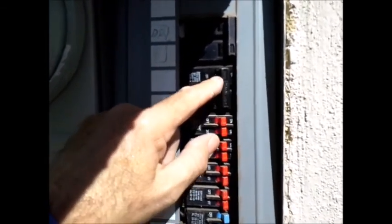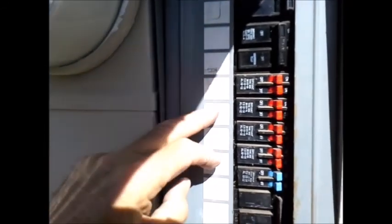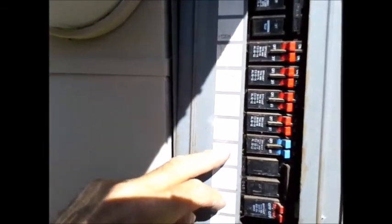At the rear of the house is the electrical panel, and you'll see the main panel breakers right here. It's 100 amp. And some of the labeling needs to be more descriptive. They don't tell exactly what room lights are and so forth. I'm going to take the cover off, and inside here, with the sunlight, you'll see aluminum wiring, solid aluminum wiring. This is something they used back in 1975. Let's see if we can get a light in there.